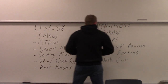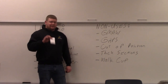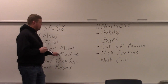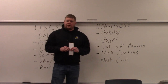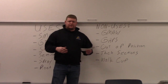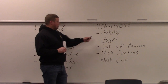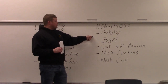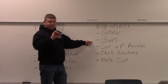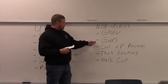Non-uses: with gas metal arc welding or MIG welding, you weave it. You very rarely run stringers unless you're doing sheet metal. If you just take a quarter inch plate and MIG weld straight across, it's going to be all high and ropey and look like a wormy type thing — it just looks not good. So most of the time with gas metal arc welding you're going to be running some kind of weave. Gaps: if you've got a big gap, you've got to weave it. Even with stick, if you have thick material butted up, you're still going to have to do some kind of weave.